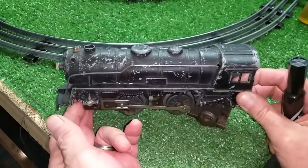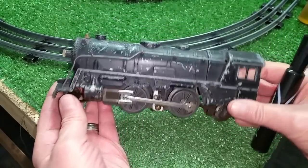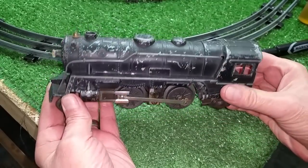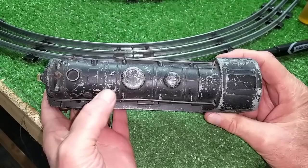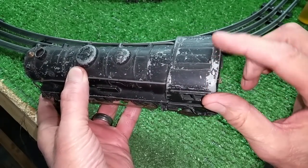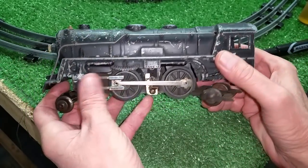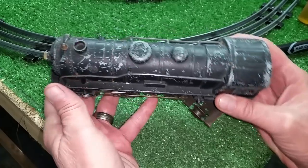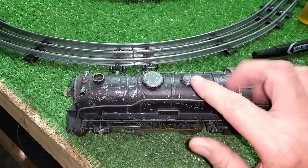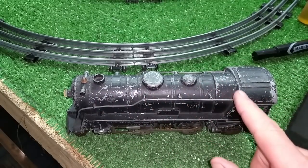You can see this one is in fairly poor condition. There's nothing wrong with it — it runs well, and there's no real damage. It's just been stored badly. When zinc is stored badly, oxide begins to form under the paint and actually lifts the paint off the metal. You've got big bare spots, speckles, just a strange pattern. It just comes off in spots where the moisture has begun to react on the pot metal.